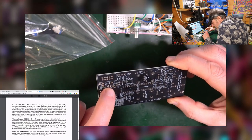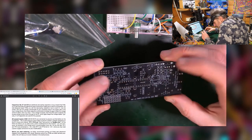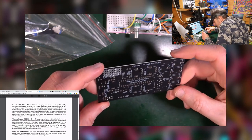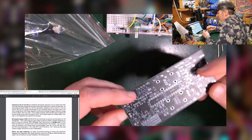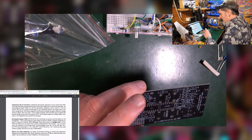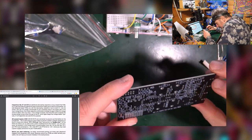You've got diodes on here with a line, capacitors, the round ones being electrolytic capacitors, we'll get to those. Chips go in the middle. And then the hardware goes on the back or on the front. So it's all on a single PCB, unless I've done something seriously wrong. The only reason I worry about it is because there's like a picture of three. But no, it is just the one. Both sides and the front panel. That's what we're thinking of. Yes. Okay. Now, this is an interesting thing, is that it says that there's unused inputs of DD1, DD1B to DD1F. So I can find those.